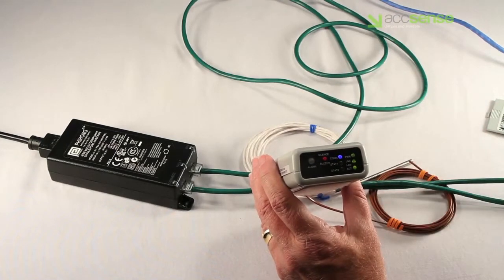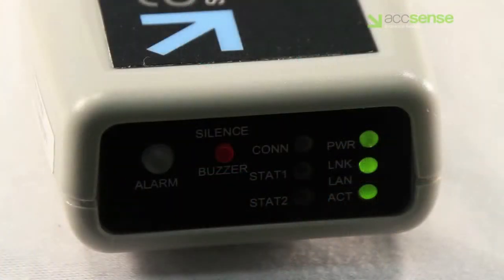This is a common connection failure. The blue connection LED is not lit. This means that the attempted connection has not been established internally because the pod has not successfully obtained an IP address from the user's DHCP server.